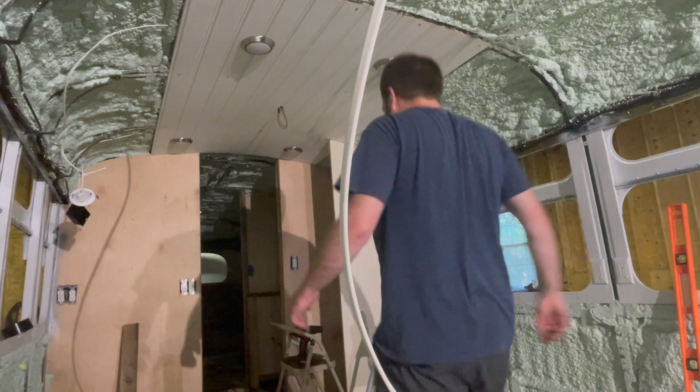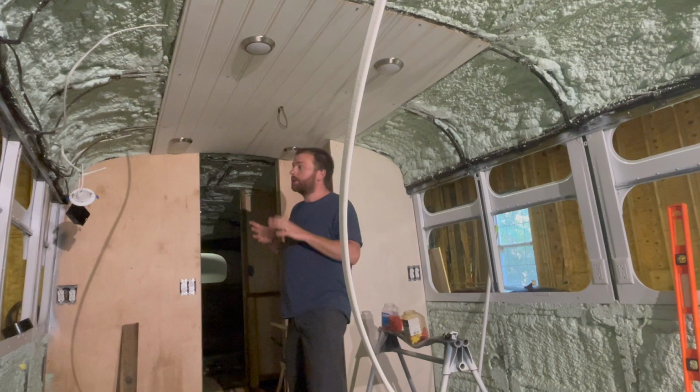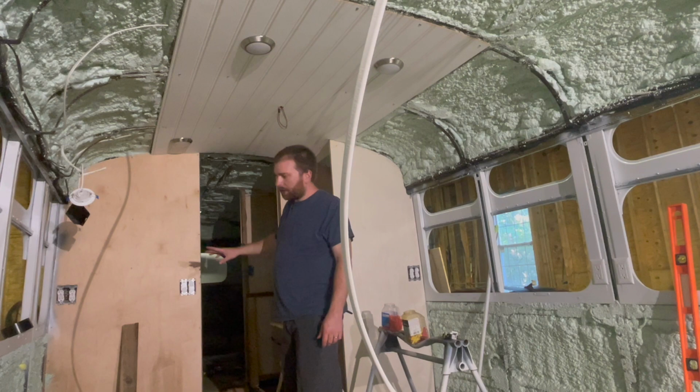All right, guys, we did a million tests. We have all of our outlets that are wired. Anywhere you see an actual outlet, those have been tested and they're working. Power probe, super cool. You can turn your power on and off just using 12 volts. That was a good, safe way to test. We know it works. Nothing's sparking or being weird. So just as a cheat, I hooked up an old extension cord to my electrical panel. Now I have 120 at these same circuits, including the four lights.